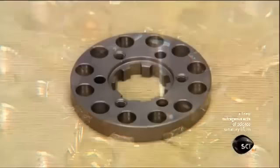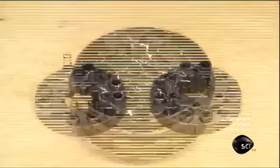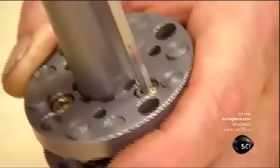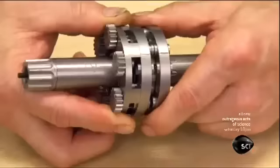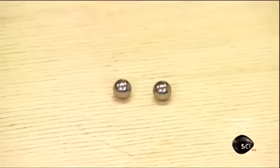Next, they unscrew the two halves of the clutch and mount eight hollow pins in each one. In one half they also install three longer alignment pins and a grease spring inside each hollow pin. Then they thread the two halves of the clutch onto the axle, aligning the axle slots in the clutch's grooves and the pins on one half with corresponding pins and holes on the other. After fastening the halves together, they mount the six planetary gears on a ring called the planet carrier, then install it on the axle. The spring-loaded pins on the clutch click into corresponding slots on the planet carrier — these slots are engineered to fit the pins with no more than 0.01 millimeters of clearance.